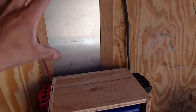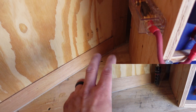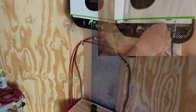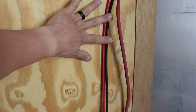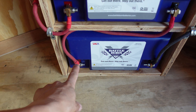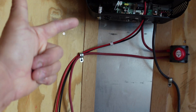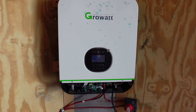Now that we're all good, you can see this is all connected. I put a screw through the floor and it comes out in a perfect spot underneath, so I'm drilling that hole to get the solar wires up. Here's the unit all wired up — I still need to neaten up the cables and put a breaker on the solar panels. We have batteries in series: a cable from positive to negative, negative to the bus bar on the right, positive through a fuse into the bus bar, then up to the unit on both sides, with an on/off switch on the positive.